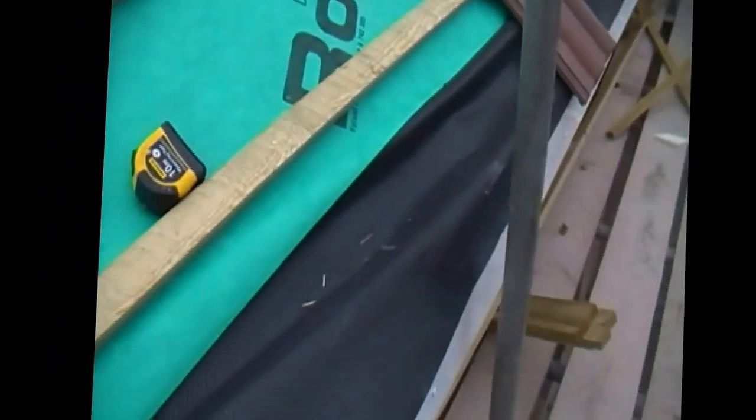The tiles are laid down over the fascia board, and sometimes tilers like to put what is called a tilt on top of the fascia board to allow the very first tile to tilt up ever so slightly so the water runs into the middle of the gutter.